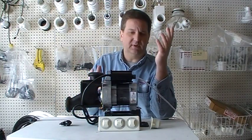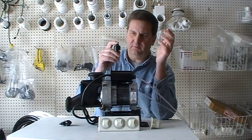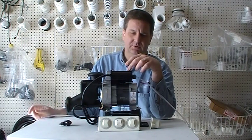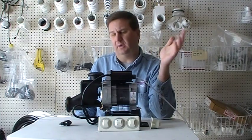Anywhere in this system, if you're hitting your button and nothing's coming on, there could be an air leak. You could have a hole in your air tubing, the diaphragm could be shot on the bellows, or the diaphragm could be shot on the back of the air switch.